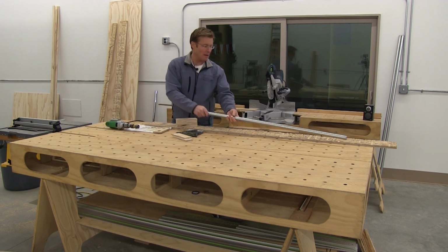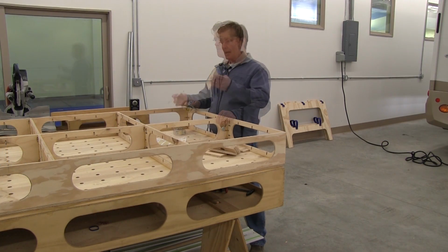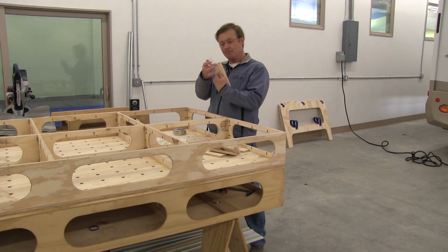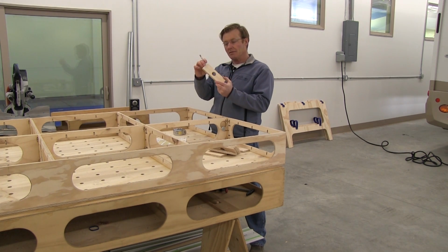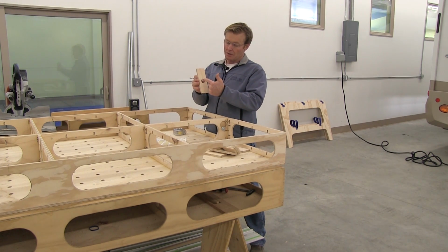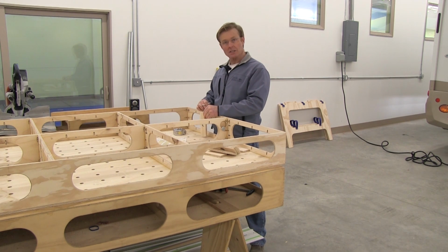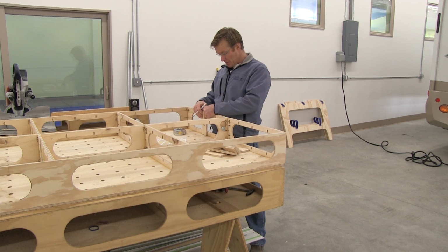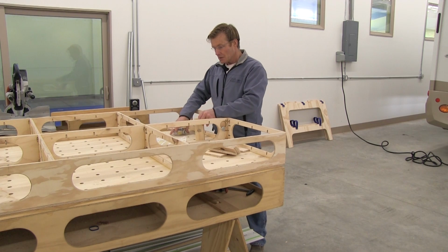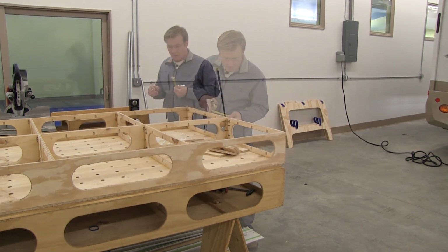Okay, I got just a little bit of play, which should help from binding. The table saw is centered, and again, I'm building this upside down, so I've marked the pipe guides with a T for top, so that I'll put that down. Not only did I put the center line to drill the hole, but I carried it up through the top, so that I know if I lay out a center mark here and I line them up, that's going to be the center of the pipe guide, or center of the hole. So first thing I want to do is lay out my lines.